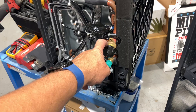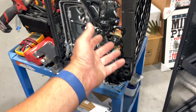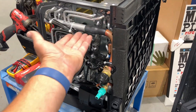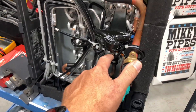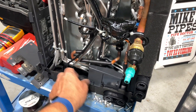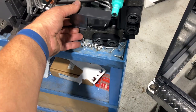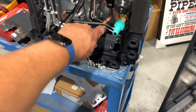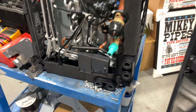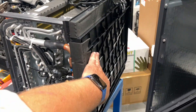A lot of Instagram HVAC guys cut the bell off a swage connection and slide on a ZoomLock — but once that's on, there's no going back. If it goes bad you can't get in there. Here we have an electronic expansion valve, motorized expansion valve, dozens of thermistors and temperature sensors, and our A2L flammable refrigerant vapor sensor — which I'm pretty sure is a requirement now. We also have a pan for vertical and horizontal installation, so it's multi-positional.